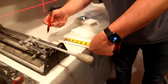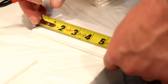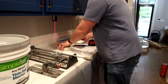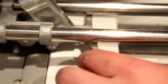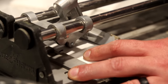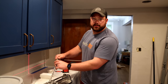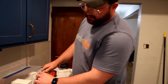I've got 6-inch tiles here — they're perfectly 6 inches. What you want to do is get a couple going, find the center. I'm going to use — I don't even know what this tool is called. It's a tile cutter. You see a lot of people using tile saws; we'll probably use tile saws to cut crazy corners, but this cutter here works great with these ceramic tiles. Get it lined up — it's got a little wheel that's going to score. Make sure your wheel's lined up on your mark, come back through, and score your tile. All you're doing is scratching the surface and it should pop nice and clean. This will go much faster than pulling out that big tile saw. Make sure you have a fresh wheel — most of these cutters come with an extra wheel in the handle. It's like a gift.